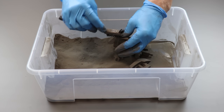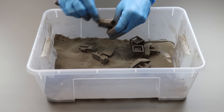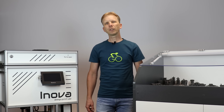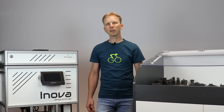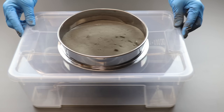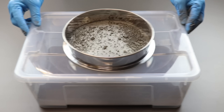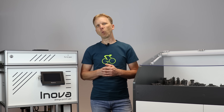At the beginning I used just two plastic boxes and a flour sieve. It worked well and was simple to use. The first box was used for removing the parts from the print cake and cleaning them using a nylon brush. Although PA12 nylon is non-toxic, it's good practice to protect yourself by wearing a mask and gloves — you probably have plenty of those from corona times. The second box was used for sieving the powder, which allows it to be recycled. I simply made a hole in the lid using my Dremel tool, then put in a common flour sieve with 100-micron mesh.